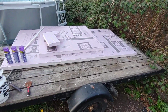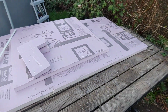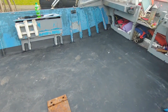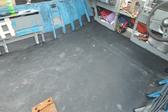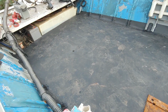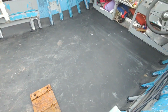2-inch Panther board insulation. This stuff is closed cell foam. And then we did spray foam between it. And then PVC bathroom wall sheathing for some rigidity. And then this is rubber roof material and some contact adhesive, and stuck it all together. Went through and caulked around all of our flaps going upright. We might trim those off, might leave them, I don't know yet.